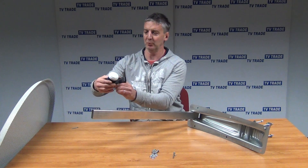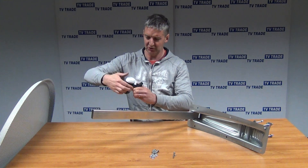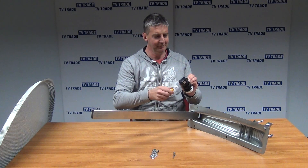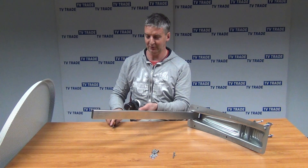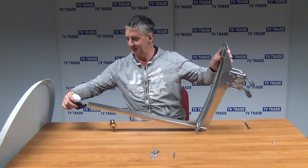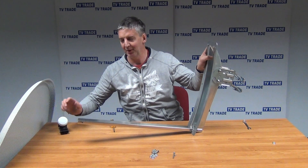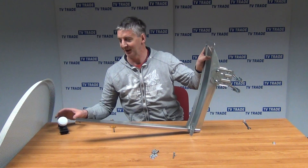I've just disassembled and reassembled this with the LNB in position. I'll take this bolt, push it straight through the hole — there's a nut on the far side. I'll just use this screwdriver to screw it and lock it into position. It tightens up very easily because the nut on the far side can't rotate, and it just angles it at the angle I want. Then we simply snap this into position — just depress either side and wriggle it in. It's tricky to get back out, but when it goes in, it's very secure.